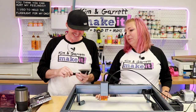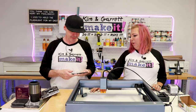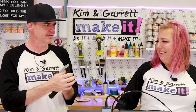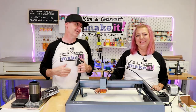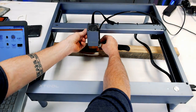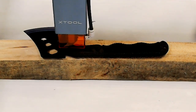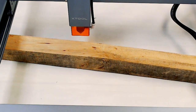It's a cool personalized manly Father's Day gift. It's also a multi-tool — survival cord, wrench, bottle opener, and cutter. We're putting his initials on it. For the axe, I tried 100 power, 70 millimeters per second using coated metal settings, but it didn't look deep enough, so I ran it again — two passes. The whole thing took 16 minutes.